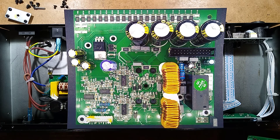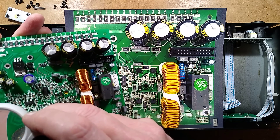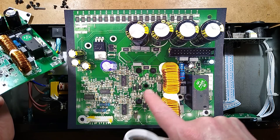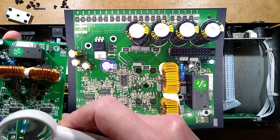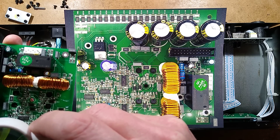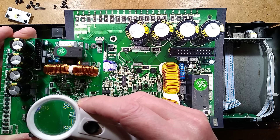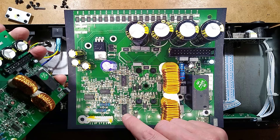We have LM319M comparators — two of them — possibly dealing with the analogue-to-digital output. Then we've got two chips here with very small text: Mega Semi, with a number ME98-1036 and what looks like a date code E2106. I drew a blank on those chips — I did not find them. But I get the feeling they are driving those transistors on the other side in a push-pull format, or effectively an H-bridge when it's in bridged mode.